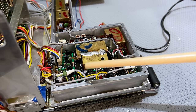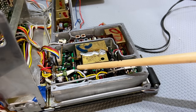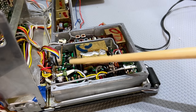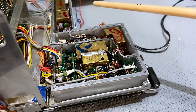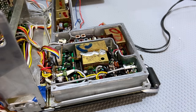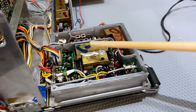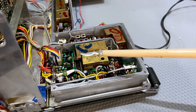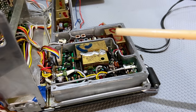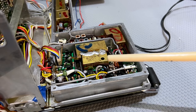I'm actually thinking of leaving the original chips in since I now have sockets and can easily swap them. I still need to solder the shield back and close this up. I can't tell you exactly why it suddenly started working, but the lesson here is: change the electrolytics. I measured them — they're not that bad, but they're old. Ultimately, by cleaning everything up and redoing the solder, something went right. Sometimes you're good and sometimes you're lucky, and I think this is a case of the latter.